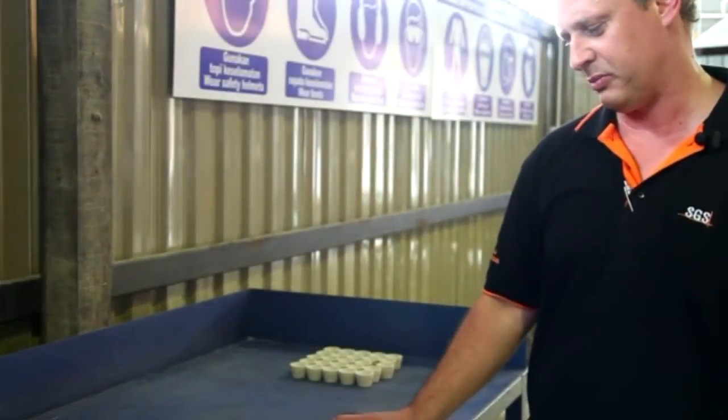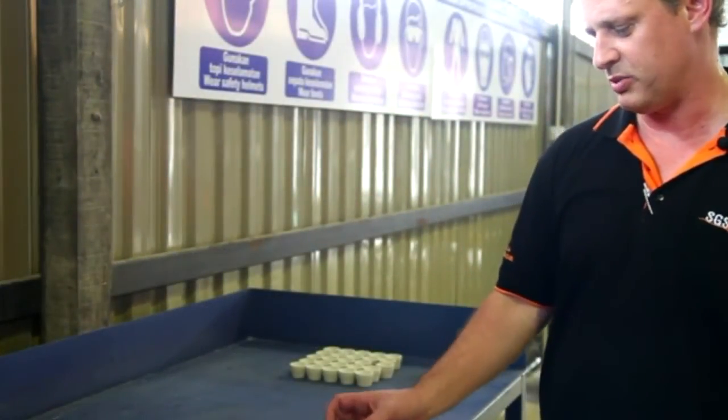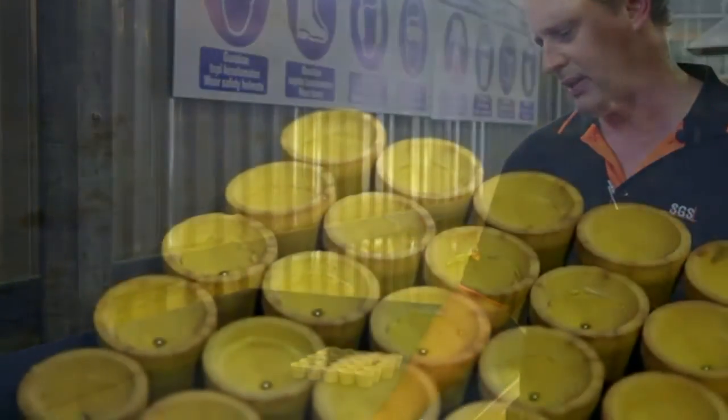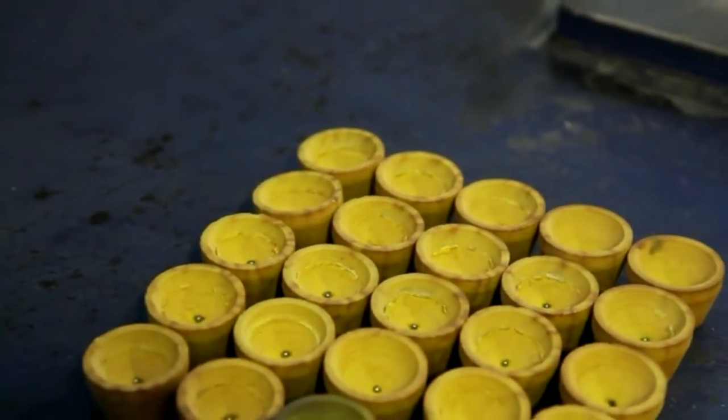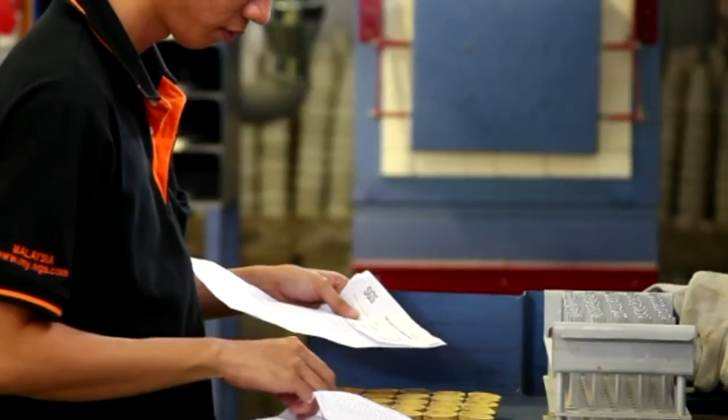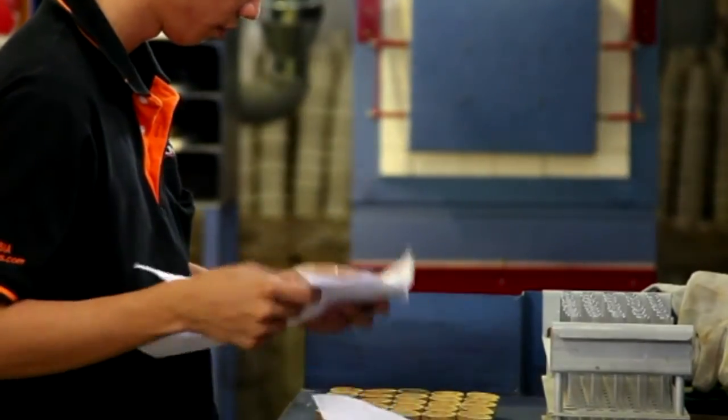At this stage the lead has been removed. It's been converted from metallic lead into lead oxide, absorbed into what we call a cupel — the cup that you see there. That leaves behind the precious metal alloy, which contains the gold from the sample as well as the silver we add at the beginning of the stage to use as a collector.